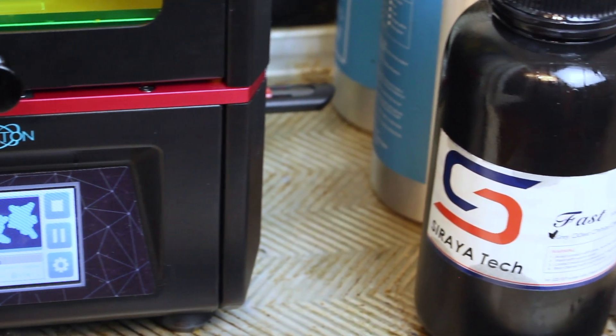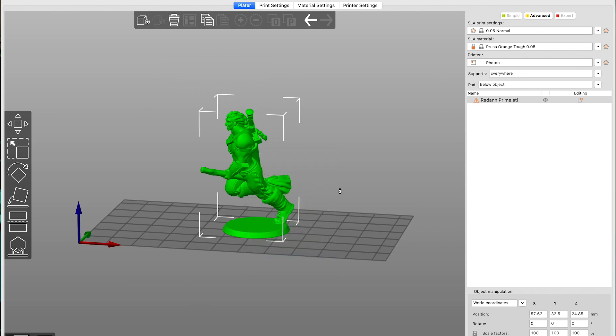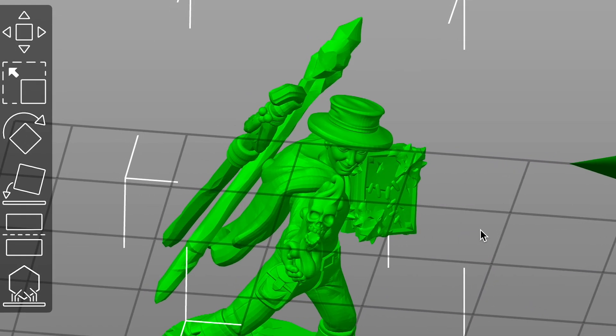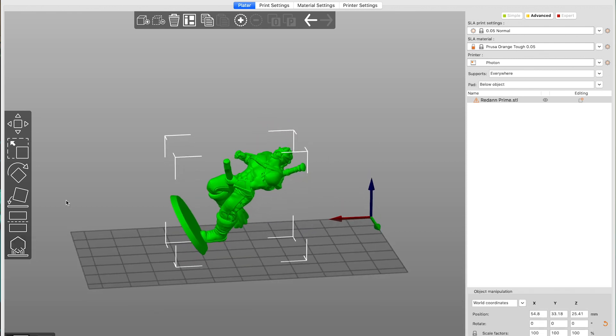So here's my workflow to get really good prints with minimal screwing around. This isn't going to give you the most perfect mini possible suitable for painting competitions, but I'm just looking for tabletop quality. I start by taking the file into Prusa Slicer and using their auto orientation feature, which sometimes they nail it and sometimes they put the mini straight on their face — which is not what you want. You want to aim for putting big chunky surfaces down so that the auto supports will grab places where it's going to be real easy to trim off the nubbins later.